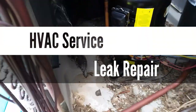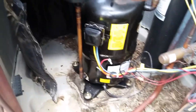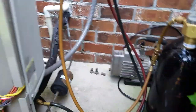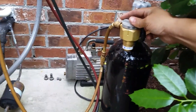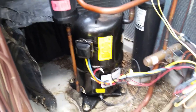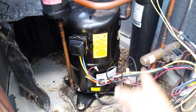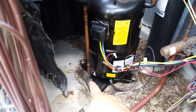What's going on guys, back out here at this compressor with the discharge line that had crack damage. I'm going to go ahead and repair that, try to get this thing back up and running. Basically what I've got now is my nitrogen over here - just put it on test, blew a bunch of nitrogen inside. I've got one of my fittings loose over here. I'm just trying to displace as much air in the system as possible, and also help boil off any refrigerant that may still be down in the sump of the compressor or in the accumulator.